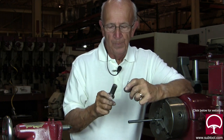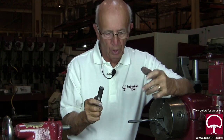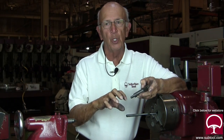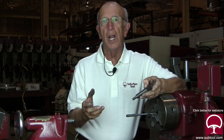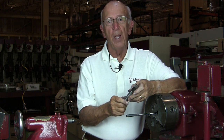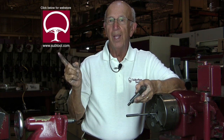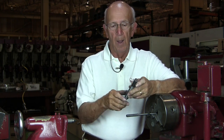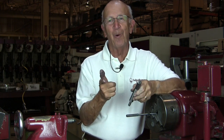If you want to lap larger parts, you can get larger laps — that's pretty elementary. But there's a point of no return; I don't like lapping beyond about an inch and a half using an arbor with an expandable lap — that's about maximum. For more information, take a look at our website at subtool.com and check out our other videos. We had a primer on lapping prior to this one, so take a look at that as well. Thanks for watching.